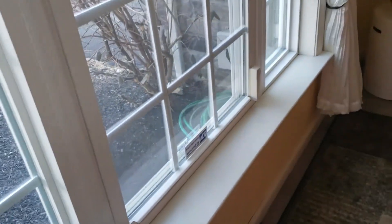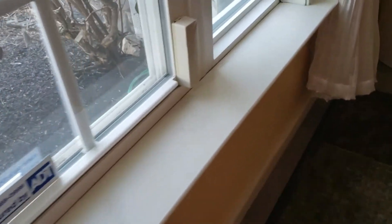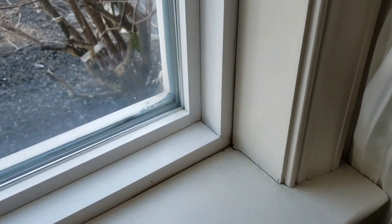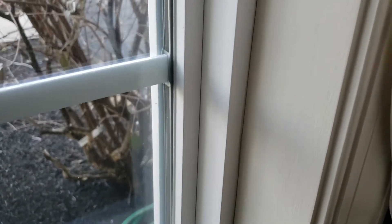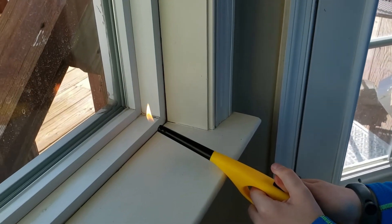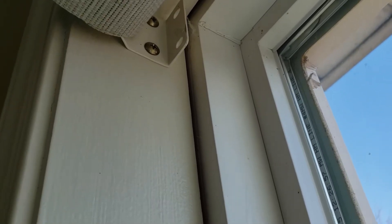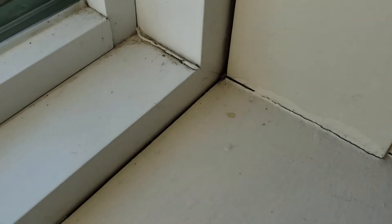So you're probably asking the question, how do I know where to seal it? Which windows should I do? I recommend putting a flame at all the cracks around your windows, and you'll see where it flickers is where the air's coming in. But you should just do them all, then they'll look the same.